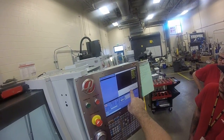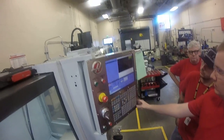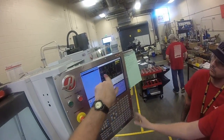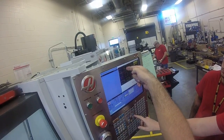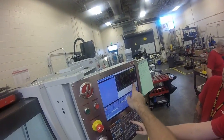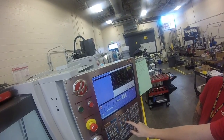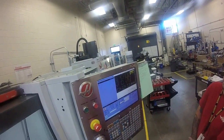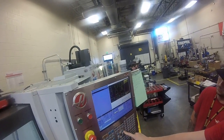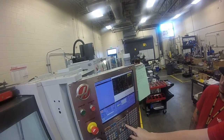We need to load the template for the wireless probe — it's never in there until you power it up. Hit F2, and it says wireless probe, so hit enter. There's our probing system. Enter 1 through 9 to see the simple probing options: probing a bore or hole, X from the left, X from the right, Y from the front, Y from the back, Z from the top. We're going to use one down here — probing a vice corner, center of block starting from center, or start center but start from corner. We're going to use this last one right here.